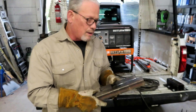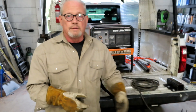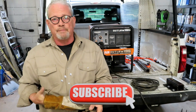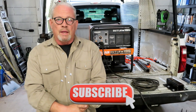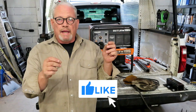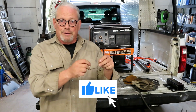So with a little practice, doing TIG off the Outlaw is very doable. It takes some practice with it pulsing like that, but if you've ever done pulse TIG it's pretty much the same thing. You just have to learn the pattern, the spacing it's doing, and know when to introduce your filler stick.